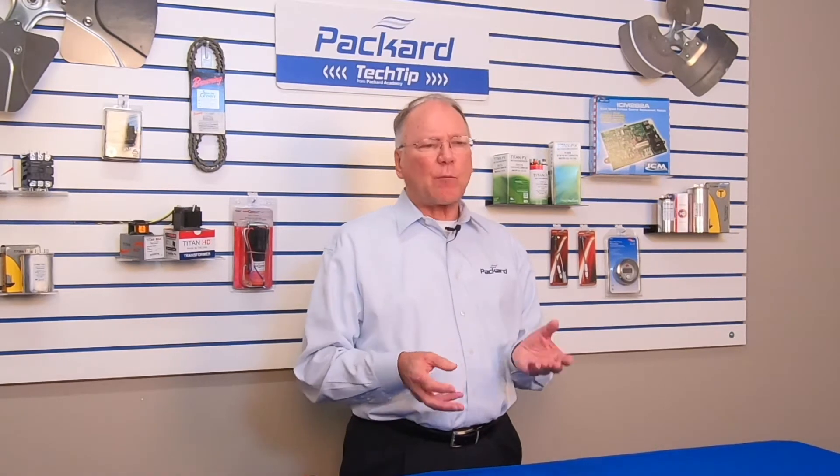When I worked in a motor shop in 1969, one of the very first things I was taught is that you always turn the power off first. I don't say that today. Now the most important thing with electricity is to stay safe, but with some of the sophisticated electronics we have today, they record problems with the equipment and show up as a fault code. If we turn the electricity off, we'll lose those fault codes and won't have an idea of what may have caused failure in that piece of equipment.